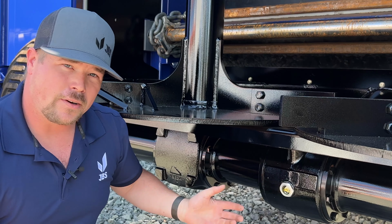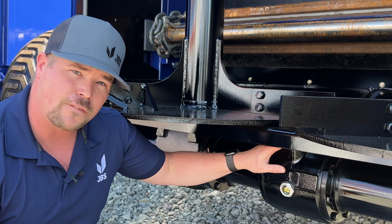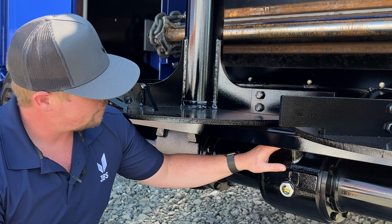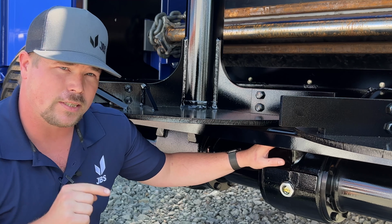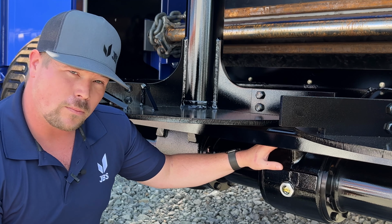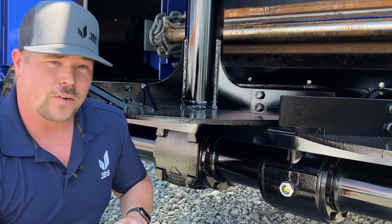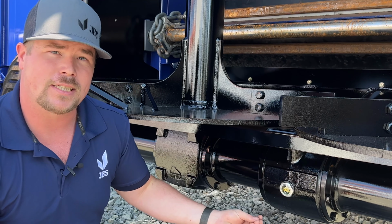Let's get to it. Here at the back of the gearbox, we have the sight glass, and above that is the fill plug. Same on both E-Series and on wide bodies. Anyways, in that fill plug is a tiny hole drilled in the side. When the gearbox warms up, air expands, it needs to go somewhere. And vice versa, when it cools down, air contracts, pulls back inside.